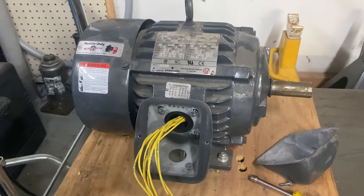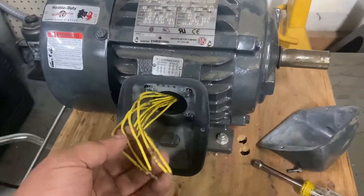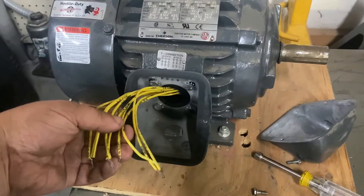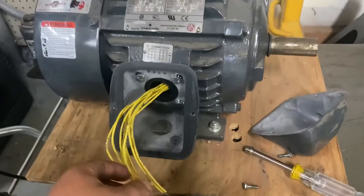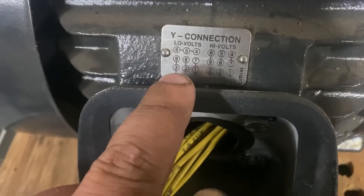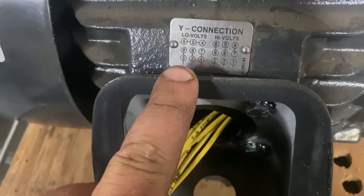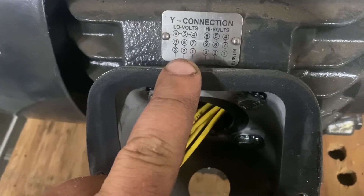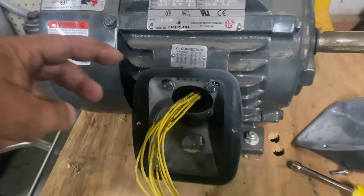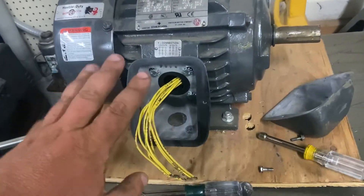You're going to bring two hot wires down from your panel and wire it for the voltage. You'll have three connections. One hot from the panel goes to terminals nine and three, the other hot goes to eight and two, and the one to terminal seven will be the generated leg. So there'll be two wires coming in and three power wires going out, plus a ground wire.